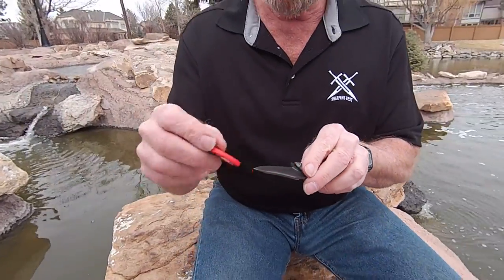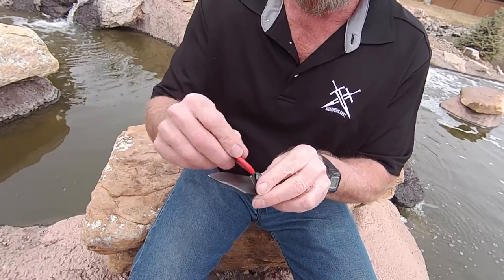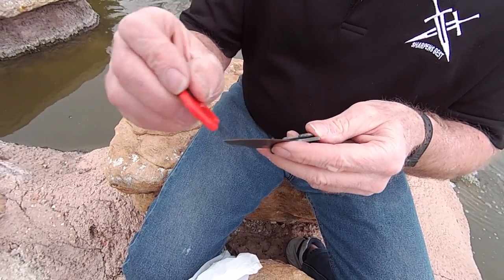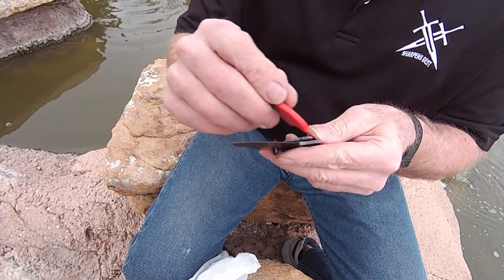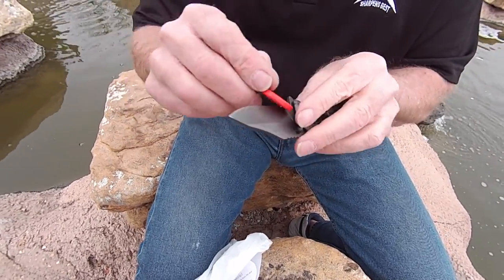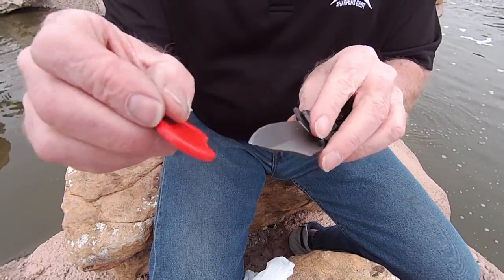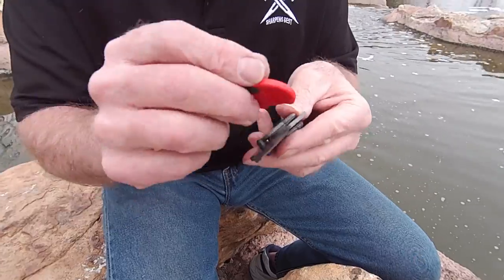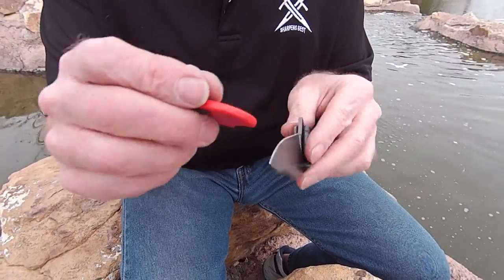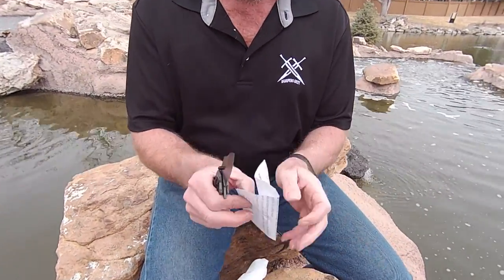So let's turn it over now and play with the other side a little bit. I always call it pestering — I'm just touching it, being gentle, just sliding along there. Maybe an eighth of an ounce of pressure because I'm already working on a sharp knife. Then we touch it lighter and lighter and lighter, and now it's really kind of floating like that. Flip the knife every pass. Now I'm just polishing on the wire edge. When I get done with the knife, there is no wire edge sticking out there. Let's try it now and see what we have.